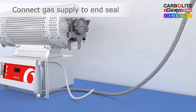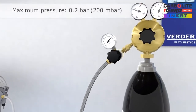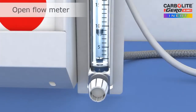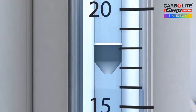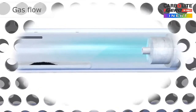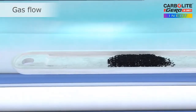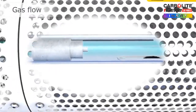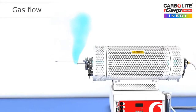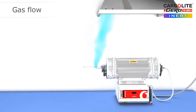The gas supply can now be connected. The maximum pressure for the gas supply must be regulated to 200 millibars, and a flow meter is used to set the gas flow rate. The inert gas enters the work tube and displaces the air, and in particular the unwanted oxygen. This purging sequence should take place below the reaction temperature. A combination of flow rate and purge time reduces the oxygen levels to extremely low values, such as 10 parts per million. Depending on the gas being used, a fume extraction hood installed above the furnace may be required, or the outlet could be connected to a pipe to take the exhaust gases to a safe location.